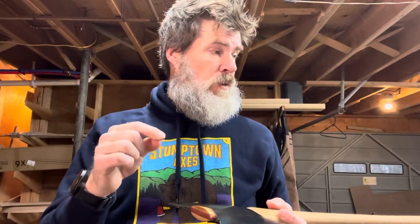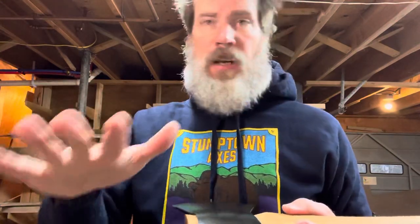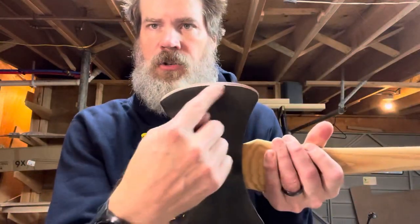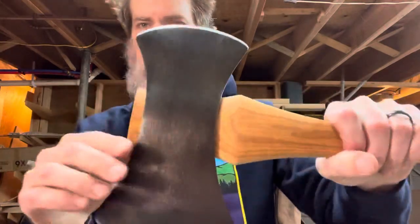To repeat what I did: 40 grit for initial surfacing, then buffed it out with a resurfacing pad, then wiped it all down with alcohol. Then I applied the bluing — Casey's Super Blue, I think that's what I'm using — with triple-ought steel wool. I just kept working that in the whole time: flip it, pour a little more, work it in. Then for the edge, you just go back over on one of your finer belts to clean up that edge. And that has come out good.